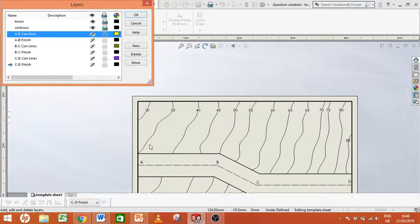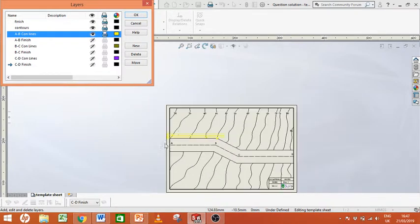The section from A to C is level at 50 meters. What we do first is the section from A to B. As we see here, from A to B we have to fill up to get to 50 meters. As fill is 1 and 1.5, we measure intervals of 7.5 off this to get the necessary contour lines for our road.